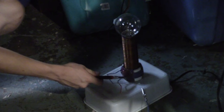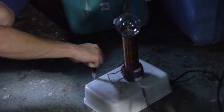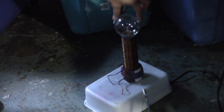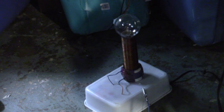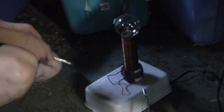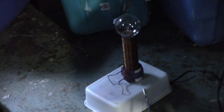It's okay — not great — but there are different adjustments you can do. You can add or remove windings to the primary coil, or you can open or close the spark gap. When the electrodes are farther apart in the spark gap, it creates a much lower frequency oscillation — the sparks become thicker and fatter but there are fewer per second. You can also close the spark gap, which produces a higher frequency but in turn will probably produce less voltage and smaller sparks, though they'll be more continuous.